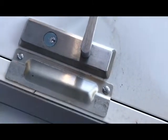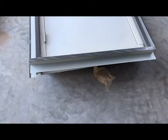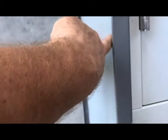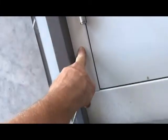The trim is going to have to go like so, so it sits like that, and then this piece is going to have to go up here at the top. I'm just trying to figure out exactly where the side wall panels are sitting and running against. Basically the wall panel will come in and tuck in under this, so I can come in at an angle and put a screw, and the outside edge is nice and trimmed. I would have thought they would have offset this part with the door jamb so that they would be flush, instead of there being a recess.